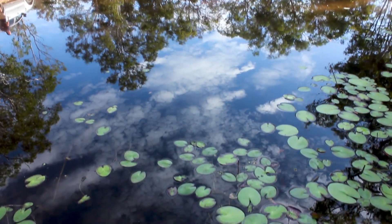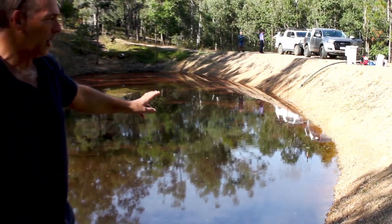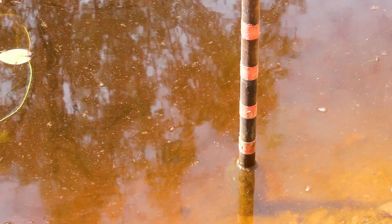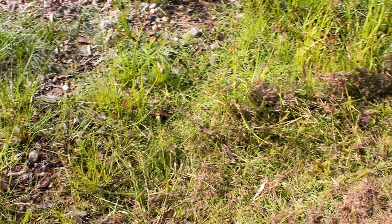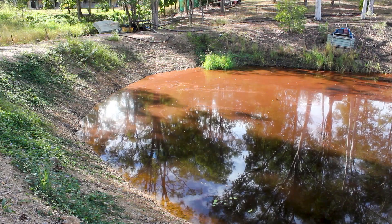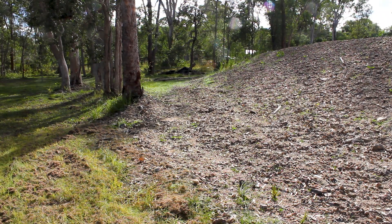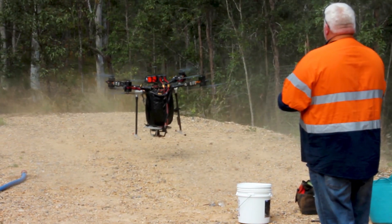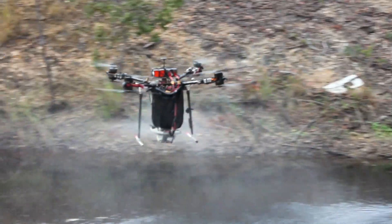Trying to understand why you've got issues or where leaks might be coming from really makes a lot of sense. You can see there are a couple of marker pegs in the dam, and what the owner has done is measured his water losses over a period of time. With some large dams you might find that some water losses are attributable to evaporation. There are some soggy patches down around the bottom — a telltale sign that you've got leaks tracking under or through the wall. The owner also explained that as the water level dropped, patches of the dam wall appeared quite wet and soggy above the water line, which is also a telltale sign that water is being drawn through those porous sections. It may be unrealistic if you've got structural problems to solve leaks totally, but you can reduce your water losses to an acceptable level.